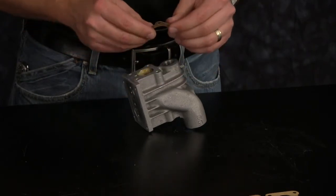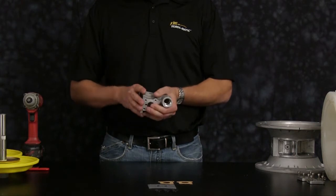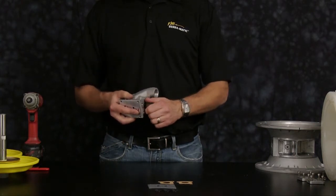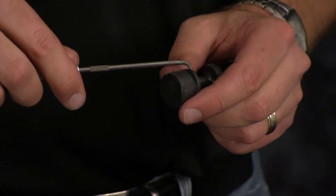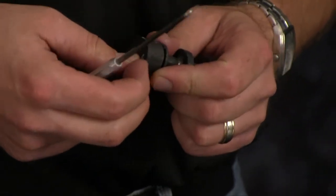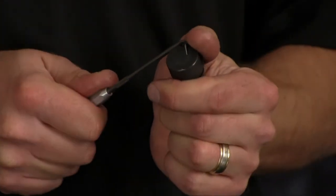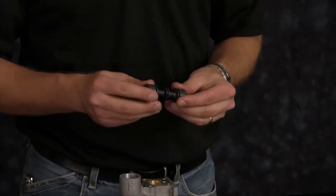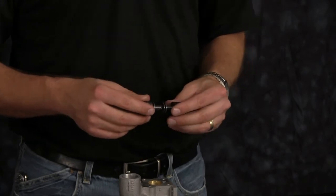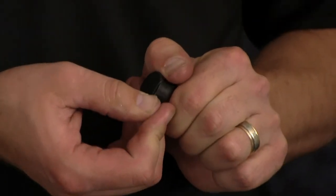Push the spool out from one end, and remove the glide ring assemblies using an O-ring pick. Underneath the glide ring itself is an O-ring. Inspect the spool for any scarring or scratching or damage. Replace as needed. Now install the glide ring assembly, which includes the O-ring and glide ring that goes over top of the O-ring.